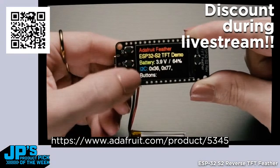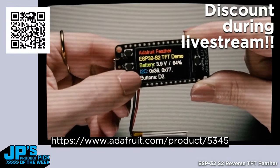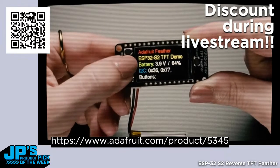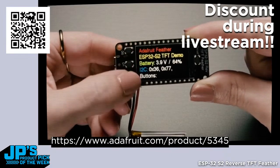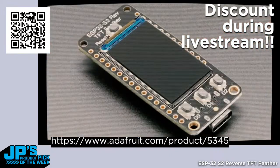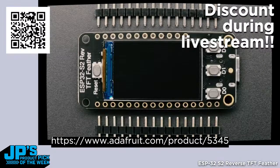The new ESP32-S2 reverse TFT feather. So this is a lot like our ESP32 TFT feather, except you'll notice that the TFT is on the back of the board, not the front of the board. So reverse. But this also means there's a little bit more space, right? Because I'm not sharing it with the USB and the whatever. And so on the back, you've got the ESP32-S2, you've got a STEMMA QT port. And on the front, we've got the TFT.